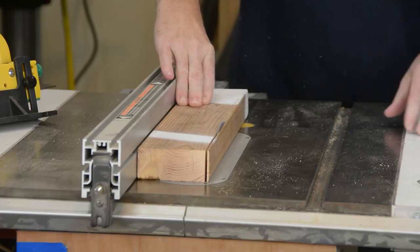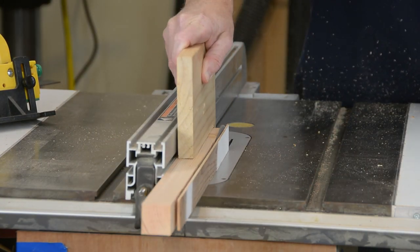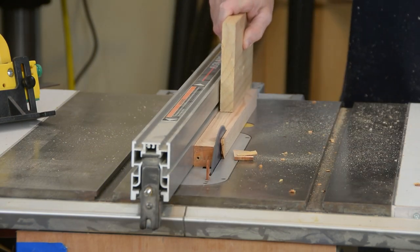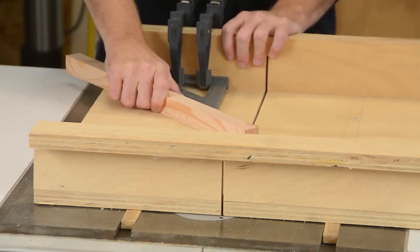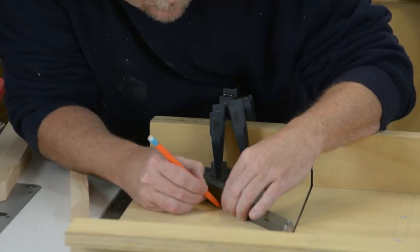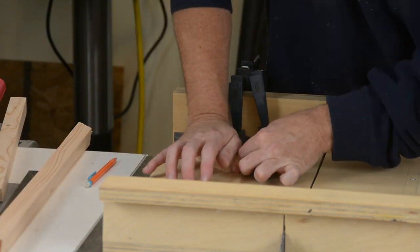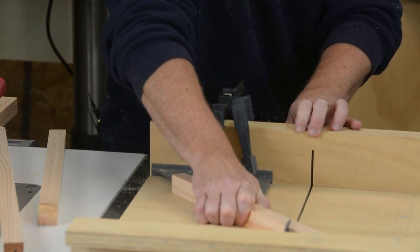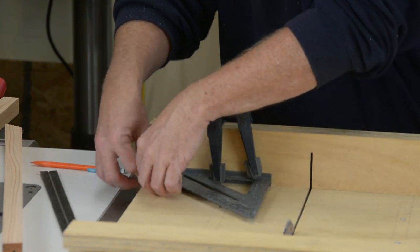I give myself a reference surface on the 2x4 by cutting off the rounded edge, then rough cut my square stock to about an inch and a quarter before setting the fence to my final one inch size. Watch out for knots when you're cutting pine 2x4s. A speed square on the table saw sled is one of my favorite all-time hacks. You cut one end to 45 degrees, then measure and mark directly from the blade where your other end has to go. Double stick tape makes a great hold-down for a stop block to get your pieces cut exactly to length — one of two critical steps to getting your miters to come together nice and square.